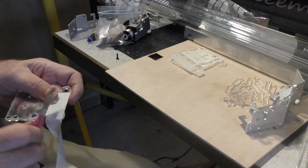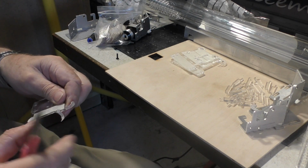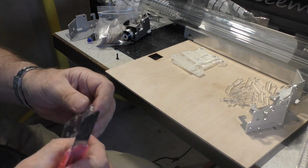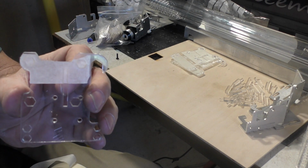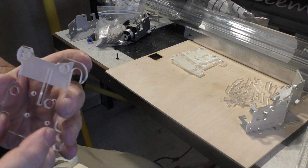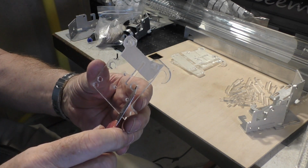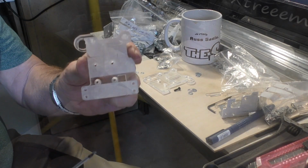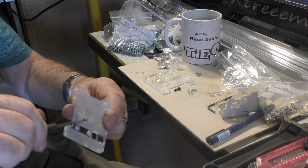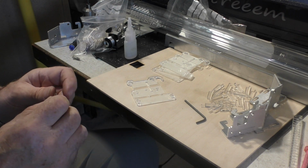We're going to run round with the edge of the knife at 45 degrees and just scrape it over the surface, and it cuts it off. So all we're trying to do is to stop the nuts from going through those hexagon holes and stick the nuts effectively to the tape on the back, the sticky surface of the tape. Now we've got to do that for these holes here and these 4 holes at the bottom. Now I'm just using my screwdriver on this one to pierce the holes through this back plate, and this is where we're going to start using these little tenons that we made.